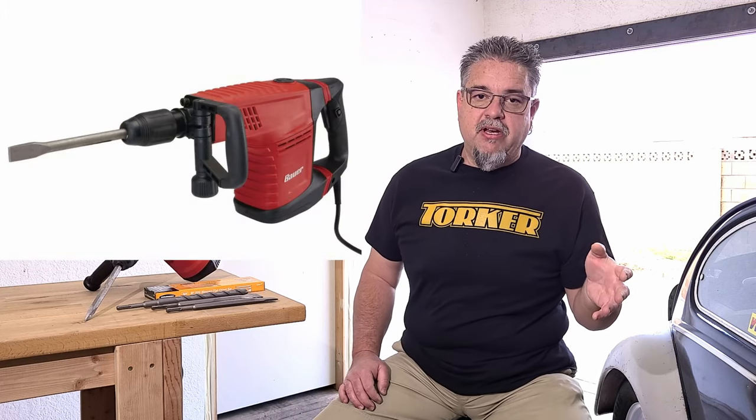Future Dean here again. I talked about the different hammers a little bit as I was doing the work, but I wasn't really that familiar with them. I've rented one before and used one before. So this is a rotary hammer — it has a hammer function like a chisel or a handheld jackhammer, but it also has a drill function. You can do those together. There are hammer drills, rotary hammers which are bigger, and demolition hammers bigger than that. I didn't realize some of the bigger ones might not have the rotary part, and I'm glad I bought the tool that did.